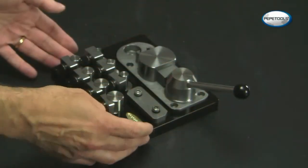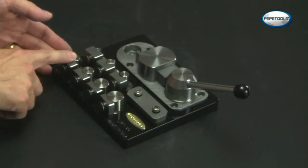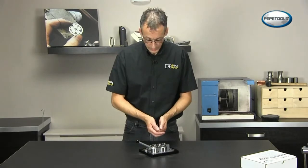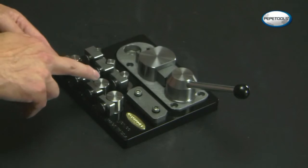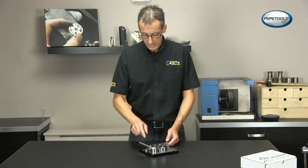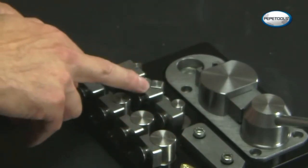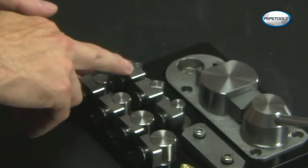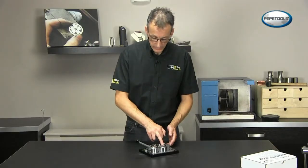The base is also the storage area for all the dies. There are 14 dies and posts in all. The round dies we have a 12, 14, 16, 20 and 22 millimeter — that's the diameter of the posts. We've also got these two others which enable us to make nice sharp crisp bends: a 60 degree and a 90 degree.